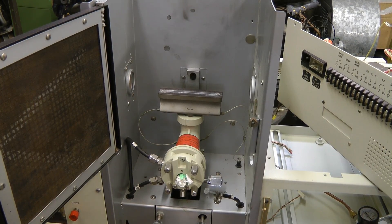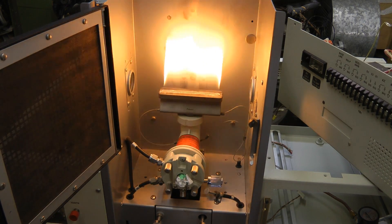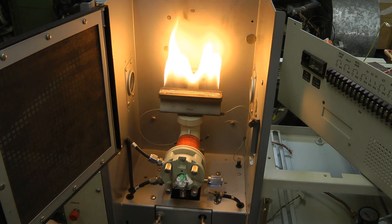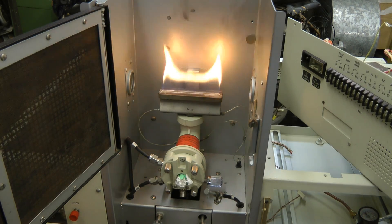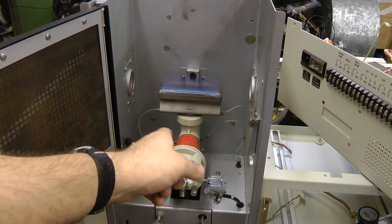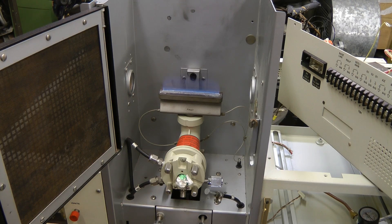I was able to get the burner running. I've connected it up to propane and air. So let's ignite the fuel. There we go. Now we can add the oxidant air. I think there's a lot of space in this chamber so right now it's just pushing fuel out. Turn it up — eventually the air will come through. There we go. It's operating pretty nicely now. A bit more air maybe. I'm thinking these cables that secure this burner piece are probably to prevent the burner from flying off should the fuel-air mixture inside this part explode.